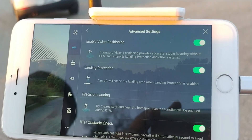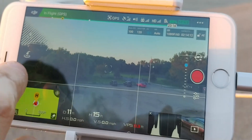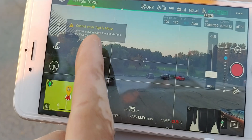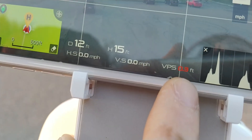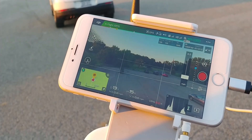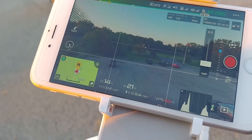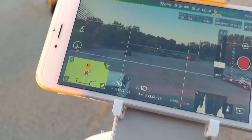I had to downgrade the firmware because I was getting ultrasonic sensor errors and yo-yoing like crazy. Tap fly was telling me I cannot enter below the altitude limit, and I was never able to get it to work. The reading is still red at 0 or 0.3 feet — sometimes it starts to work for a second or two but then says 'not available.' It still flies normally, but it limits my speed because it thinks the drone is right above the ground, and you can see how slowly it descends.